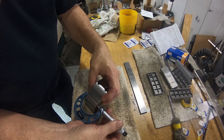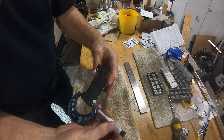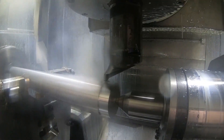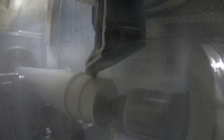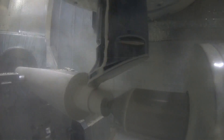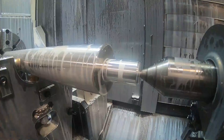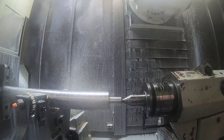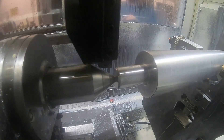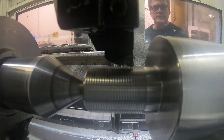So except for deburring, that's what I'm calling the steady rest support piece. Here's the aluminum mandrel piece. I'm going to turn the end of it to take the nut that you saw in the previous video - I showed the Esprit programming and everything on the nut in that video. Just roughing it down to an inch and five-eighths diameter, then coming in with the threading tool to cut the inch-and-five-eighths twelve thread. I was trying to run this without coolant so you can see what's happening. Measure the depth of the thread, adjust the offset, and rerun the tool to bring it down to size.